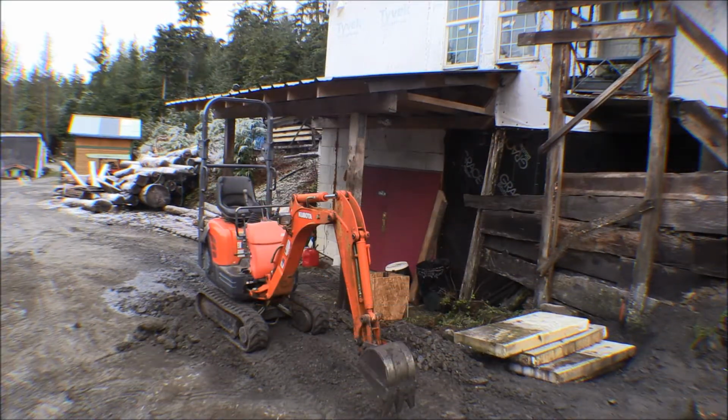I've got the forms set up in these upper 2 holes, and they're all in there and backfilled around the forms and everything. Well, they're ready to, well, I'm going to put some sand in the bottom of them, pack down, and then they're ready to pour concrete in.